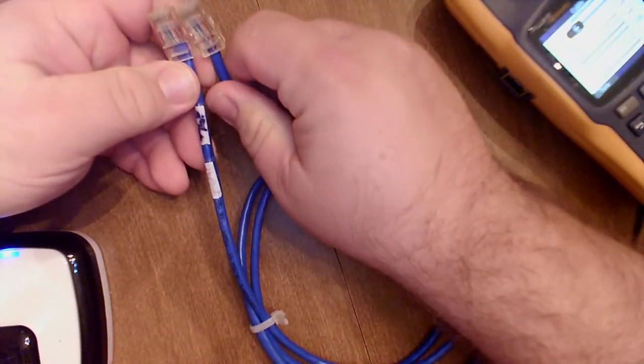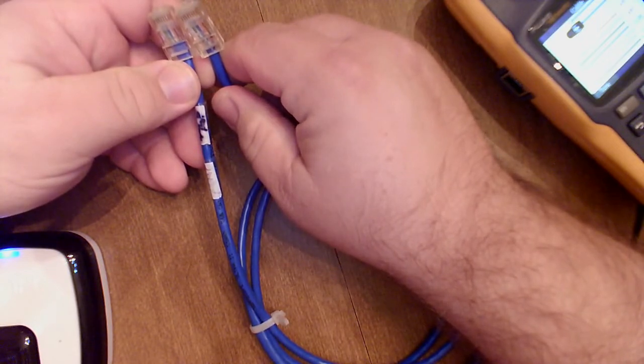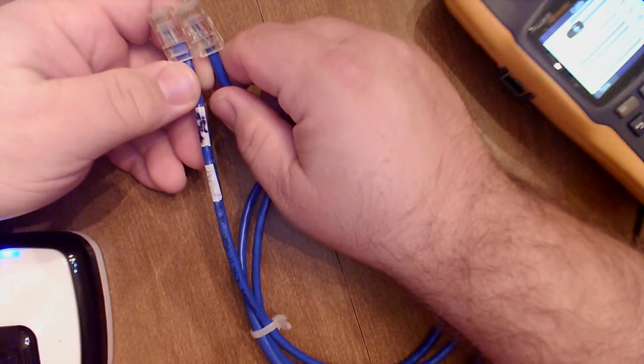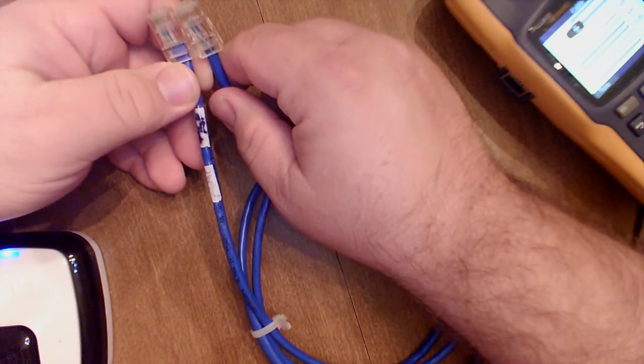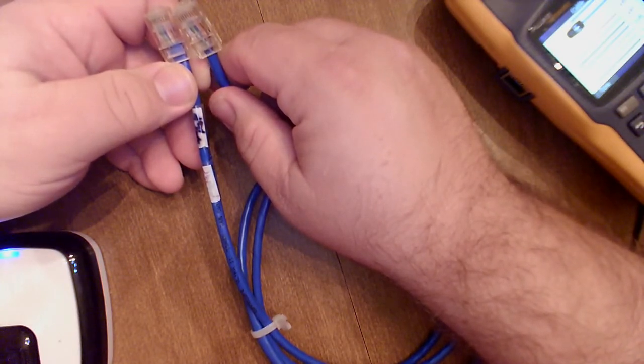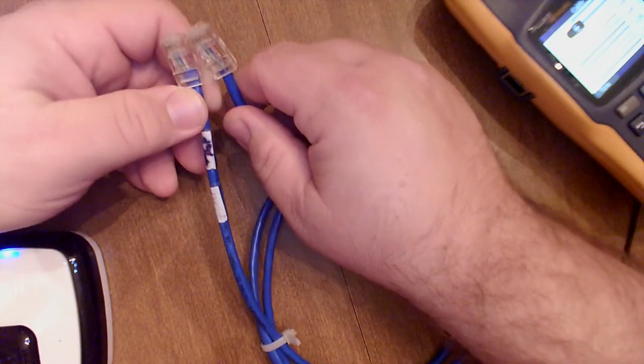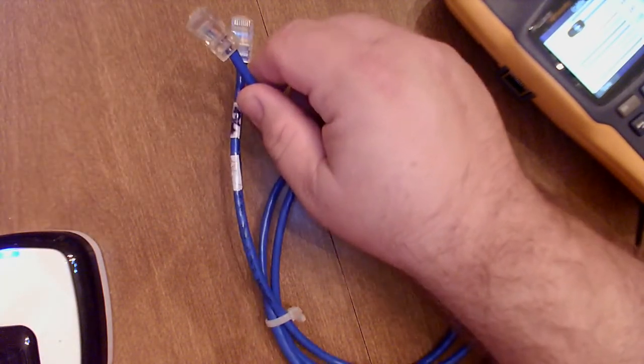And if I look at this cable, what you end up seeing is white orange, green, white green, orange. Oh no, we have the orange out further. We have white orange, green, blue, white orange. So we had a case where the orange and the greens are getting flip-flopped. It's kind of an odd split in this case, but that's what's going on, creating that split pair.